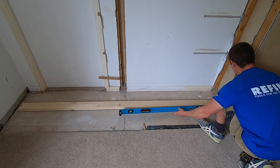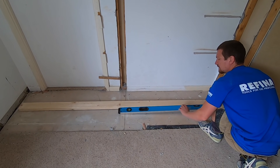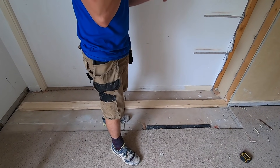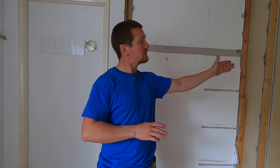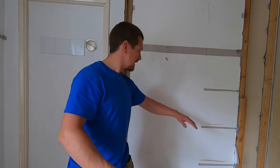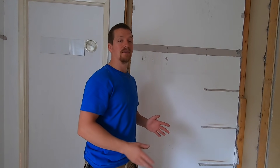So I've got my level. What I'm going to do is run it from that point through - actually looks pretty good, which is always nice. I'm going to mark all the way through there but not fix it down just because things change. I'm going to build the wall up and then follow it through and then fix it into place. It's actually sometimes easier to start again because when you're working into an existing wall you've already got set parameters there. But if you're building from scratch you put your timber down on the floor where you want it to be, parallel it from the walls aside, and then just build up plumb. So actually this is harder than building a stud wall from scratch.